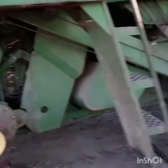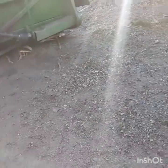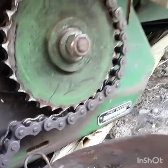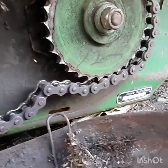I was working on filling the wet bin yesterday and something went wrong with the corn head. Inside this cover here, that front gear took a crap, so I got my money's worth out of that one. A couple of sprockets and some chain and we're good to go again on this.